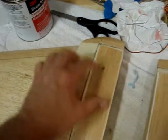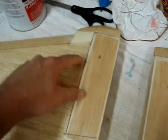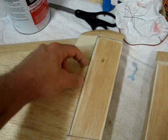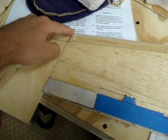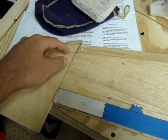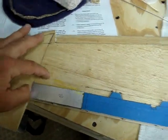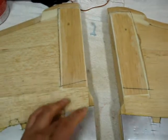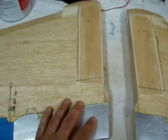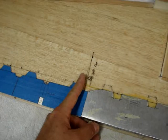Then from this aluminum machine bearing holder I'm going to have a quarter-inch end grain carbon laminated wing spar that runs the entire length of the wing panel out to about this point. There'll be another eighth-inch balsa end rib that'll be carbon laminated on both sides. Then I'll have another eighth or three-sixteenths balsa end grain spar that'll run the full length of the trailing edge as well, back to probably an eighth-inch ply and carbon laminated rib as well.